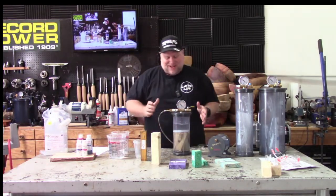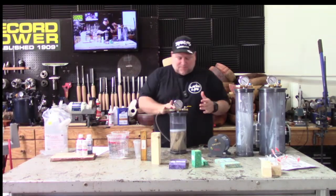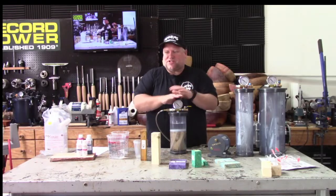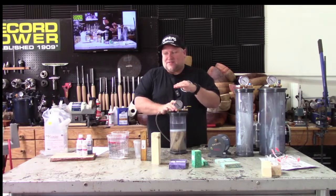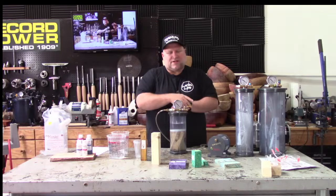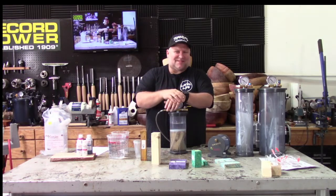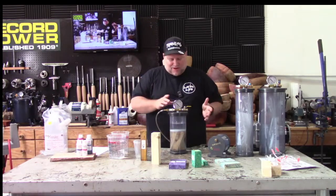All right. But one term I do know is vacuum. So we're going to pull vacuum on this. Perfect vacuum is 30 inches of mercury, 30 Hg. I don't know how Hg converts to inches of vacuum, but that's what it does, and that's at sea level. I think the most we get on our pot next door is like 28 and a half. Sometimes it looks like it's touching 29. I don't know if it really is. So 29 would be probably pretty perfect here.